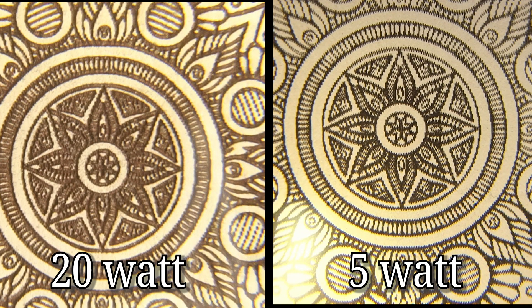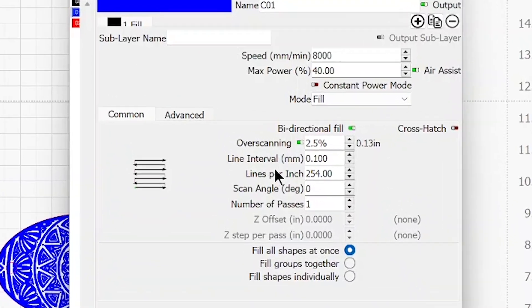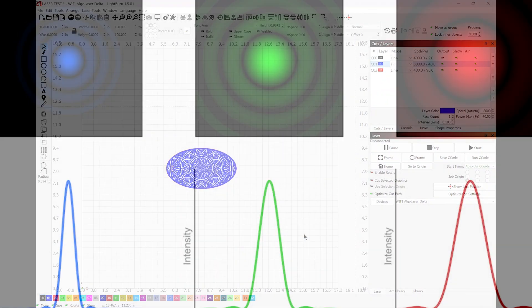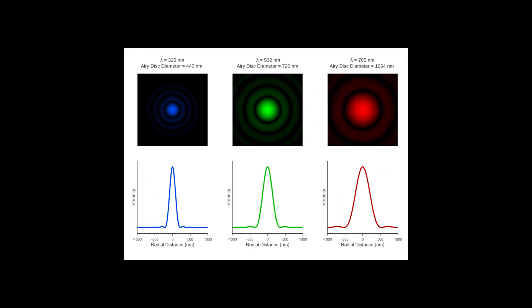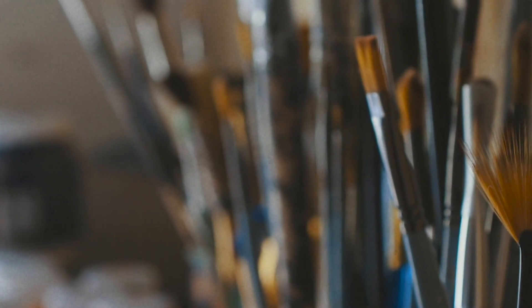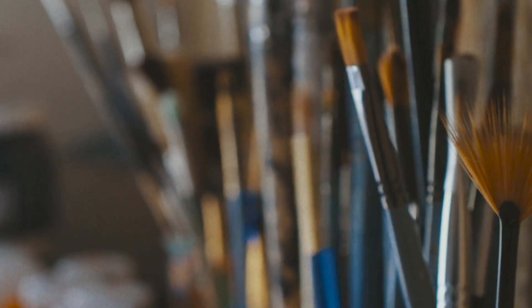Here's the side by side comparison of a 20 watt laser and a 5 watt laser. Remember that setting these lasers up is as much of an art as it is a science, so you could change a lot of factors and get a different appearance. You can change the DPI, the amount of power the machine is running at, and the speed. But the size of the optical density when the laser hits the actual material is really important — that's where your detail comes about. Remember: your spot size is the size of your brush, and the smaller the brush the more detail you're able to paint with.